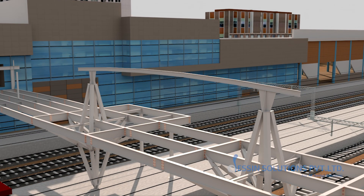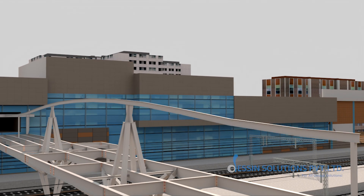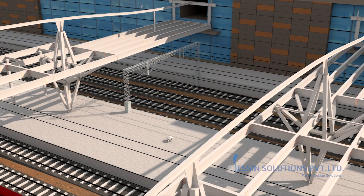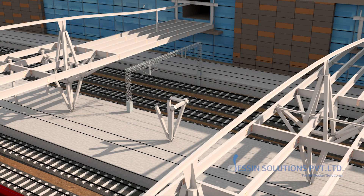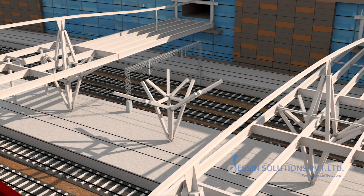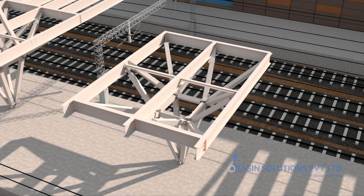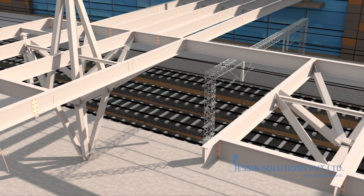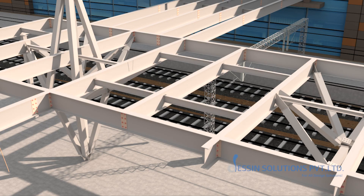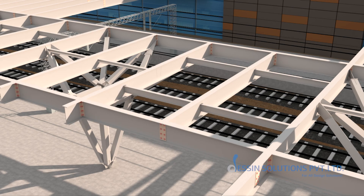Valley girders will be lifted in 3 parts. Cranes will shift again, maintaining strict clearance from station dimensions, and the B2 tree columns will be erected exactly as before. The delicate sequence of lifting, splicing and bolting eye girders will repeat in this zone, extending the canopy further.